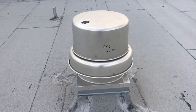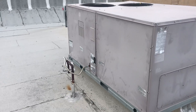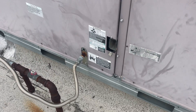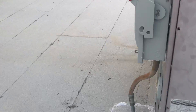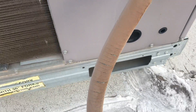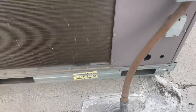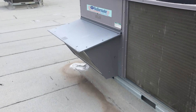I appreciate whoever wrote the belt size on exhaust fan number one — I appreciate that a lot. Coming over to look at another RTU: looks like we're missing the little vent right here on the gas heater. It's a gas heater, so the flue vent cover — that little 45-degree flue vent cover — is missing. Same thing here: looks like a new disconnect, but the seal-tight is original and we've got a little bit of cracks. There's also a little bit of hail damage — a few spots — but we can clean those out and straighten them out.